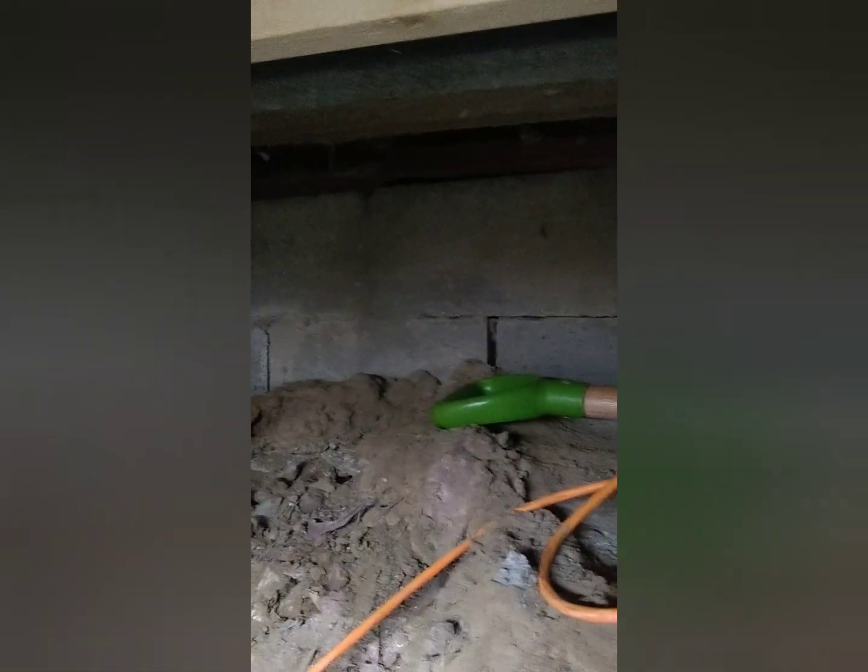This whole room that I'm starting in is going to be ripped off at one point and rebuilt, because you can see the block work they've done here. This here is the bottom course — there is no real foundation under this room — so this whole room is going to be gone and replaced.